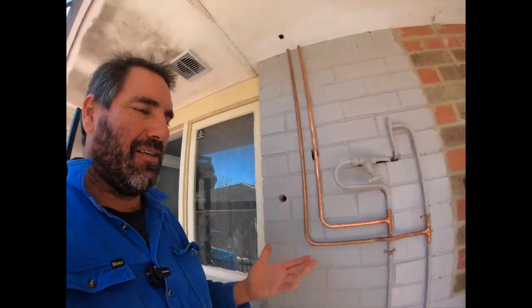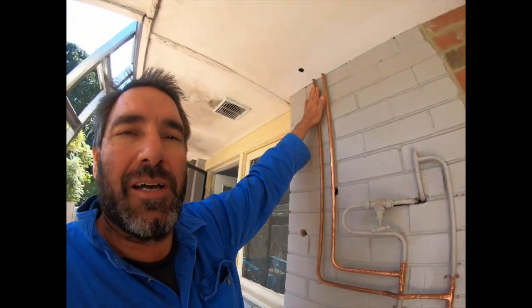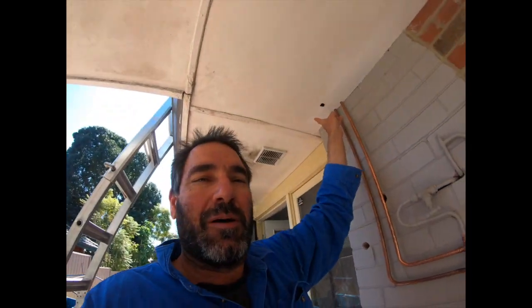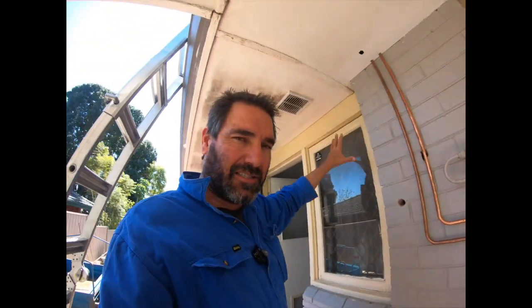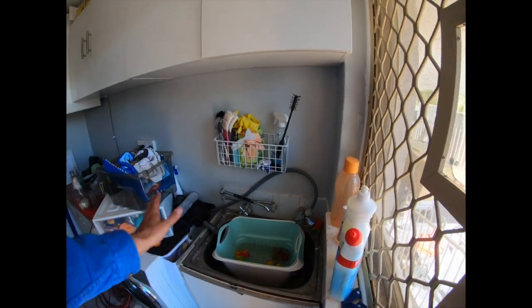One other thing I'll show you is how we're getting the hot and cold water up into the roof. It's as easy as this — you've got your hot pipe here that we've teed in, and that's going up. So now we've got the hot pipe up in the roof. The cold line joins on here and goes up. Once we're up in the roof, in the future when the laundry gets renovated, a couple new lines in the wall, down there, and it can all be redone. So from then on, there are no water pipes in the floor underneath this floor anymore.